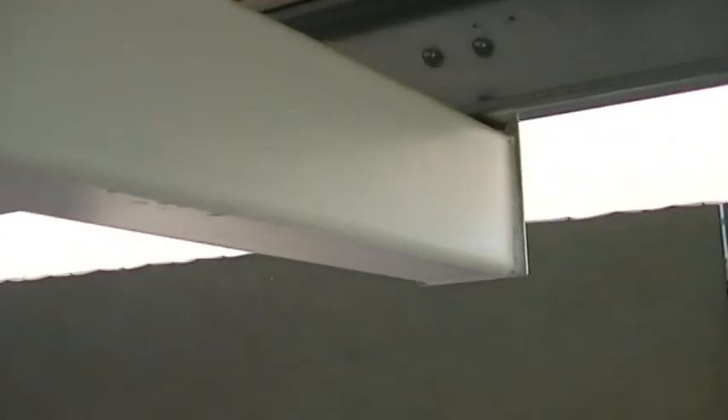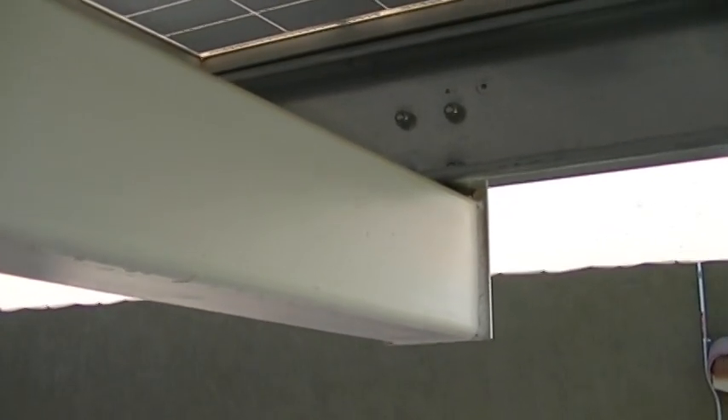Let me show you the welding on this. There is no visible weld. It's called a groove 100% penetration weld — you put a backing plate behind the weld, do 100% penetration to really get a good weld in there, then grind it down flat and it looks really nice. Very clean looking all the way down the line. We have the end plate welded on as well.